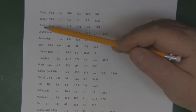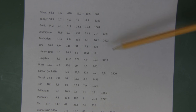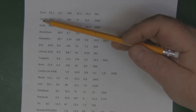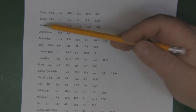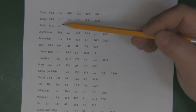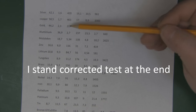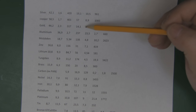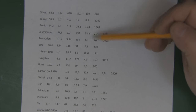There is a big difference between an antenna and test equipment. An antenna made for test equipment as a calibration tool will be a precise antenna made from expensive metals and coated in gold. But when making an antenna for Wi-Fi, you won't see any real-world difference from using those materials — you'd only see a difference in percentage if you tested it on a network analyzer in ideal conditions in an anechoic chamber, and even then it would be really small.